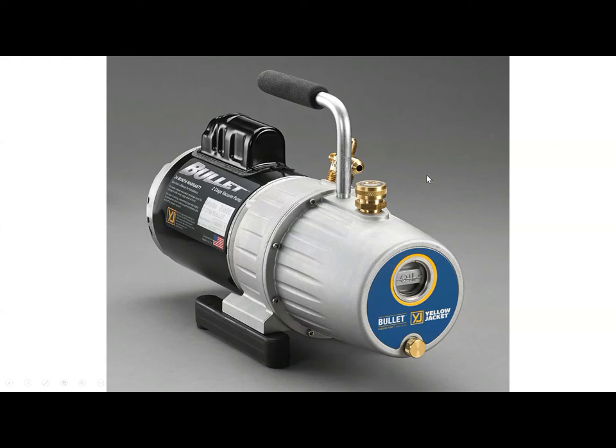Going back up here, this is the oil port and exhaust — it serves two purposes. The exhaust will come out of here, and to fill the pump with oil you would use this port as well. It's a nice deep port, so if you're using a funnel you can actually put the funnel in there and let go of it and it'll stand upright by itself, freeing up one of your hands.